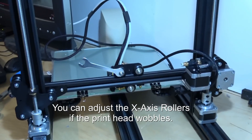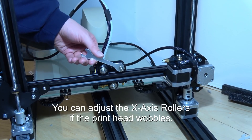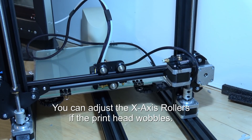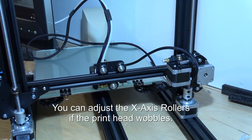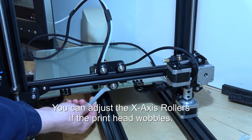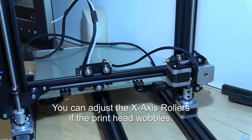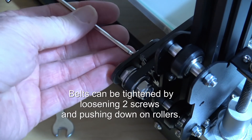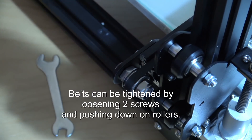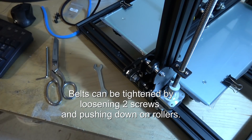You can take your wrench and make sure the nuts are just tight enough so that the head doesn't feel loose on the rail. Ours seemed pretty tight from the factory. This one here has a nut underneath, so keep that in mind — you want it fairly tight but not too tight. This belt can be tensioned the same way: loosen the screws, push down, and tighten.